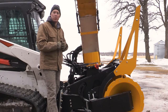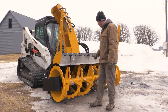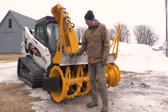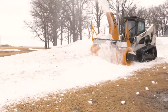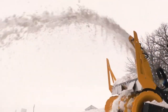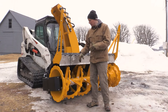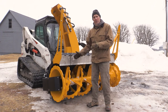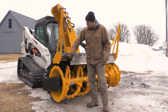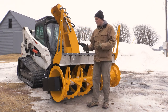Another feature on the front side of the blower body are the stainless steel shields. They're segmented so they're less prone to bending, and they're pivoted and mounted to small brackets on the frame. They're here to prevent material that might be spit or thrown forward from the auger or fan, keeping the snow knocked down and in front of the snowblower. This is really nice for when you're cleaning up near the end of a run. They're pivoted so that if you cut into really hard snow they'll just fold back rather than be damaged, and they're made out of stainless steel so they won't corrode.